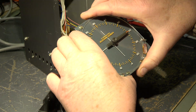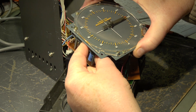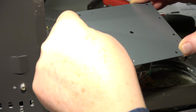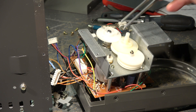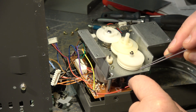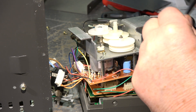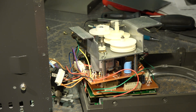I set it to 270 degrees as it was — I can actuate it by hand. I carefully set it to 270 and now the gear is open. I remove these four screws and take the metal cover away. Now we have access. Here is one pulley from the motor, and the other one is underneath here. But I do not get direct access to it — there's also a closed wheel here which has no space. I cannot go through it.